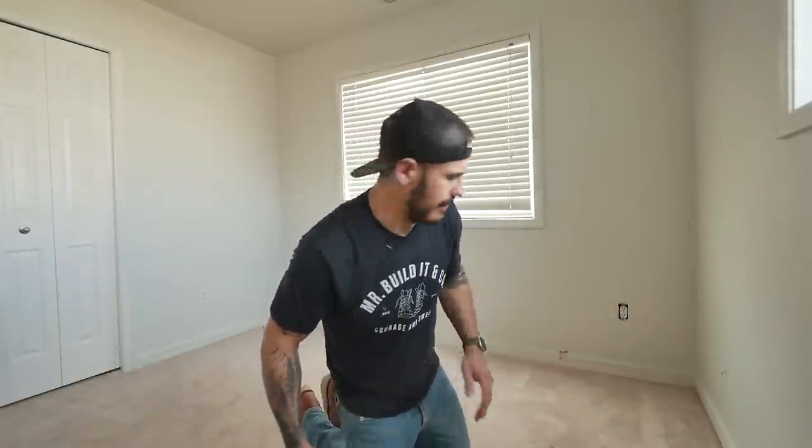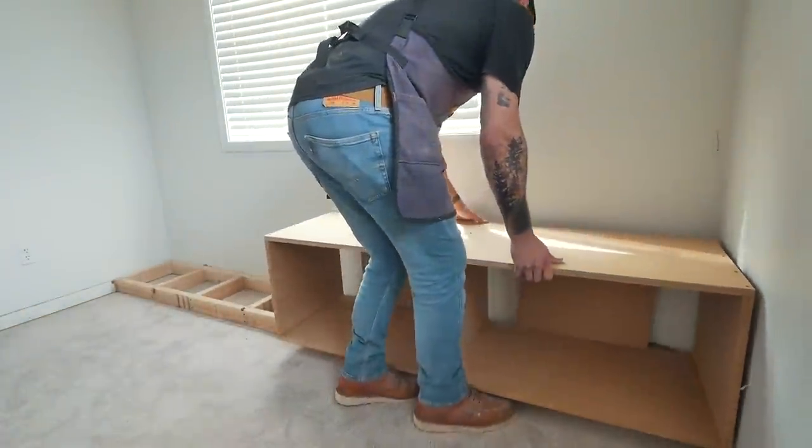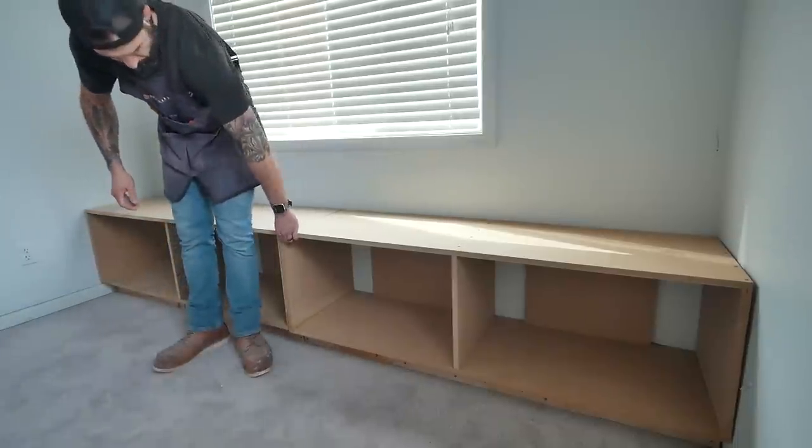We're going to need to take down these baseboards just because this entire unit is going to be fitted with baseboards wrapping up here. I debated: do I cut the carpet out and install the unit for easier balance, or just position it on top and secure it through the ground in case the next owners want more room? I figured better safe than sorry — let's put it on top. Then I marked out all the studs from the cabinets and secured the base cabinet both into the wall studs and the 2x4 toe kicks.